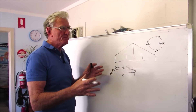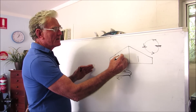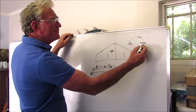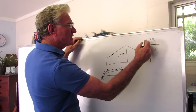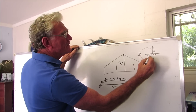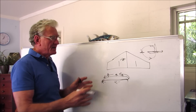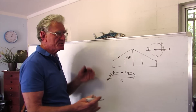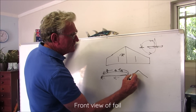I had to think outside the square. You don't get this tumbling motion in air, so the aerodynamics of a wing shape is fine. I thought that if I fed a foil lengthwise — by the time it comes through to the front point, it's getting downward motion while it's still getting upward motion at the rear. So I made a hydrofoil lengthwise. To make a hydrofoil lengthwise it's got to produce lift — very difficult to get an aerodynamic shape along there. But you can't compress a liquid, so let's create a hydrofoil of that shape.